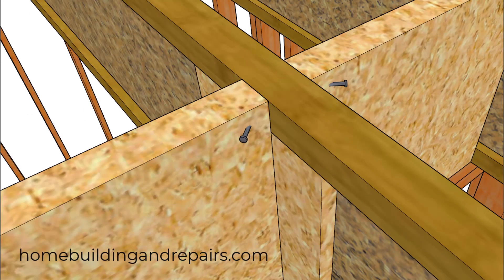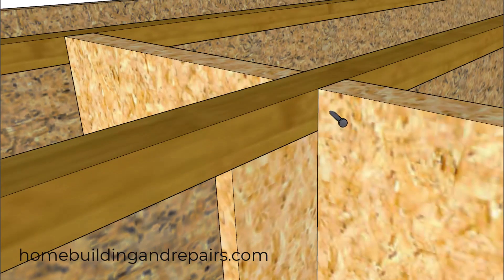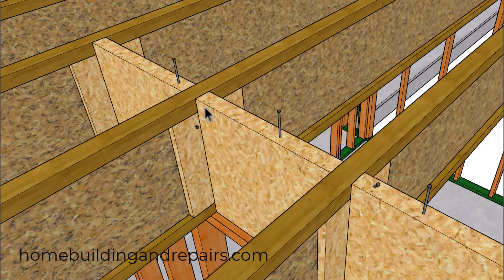Here's an example of what I'm talking about: if you're going to use four toenails to attach the blocks to the top flange, I think something like this is going to split the flange. I will put the name of the booklet I got this information from in the comment area. By using the information in this video along with the manufacturer's installation instructions, you might be able to figure out something that will work for your project.